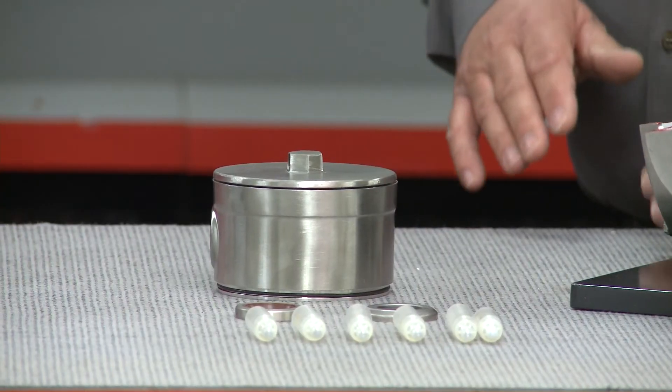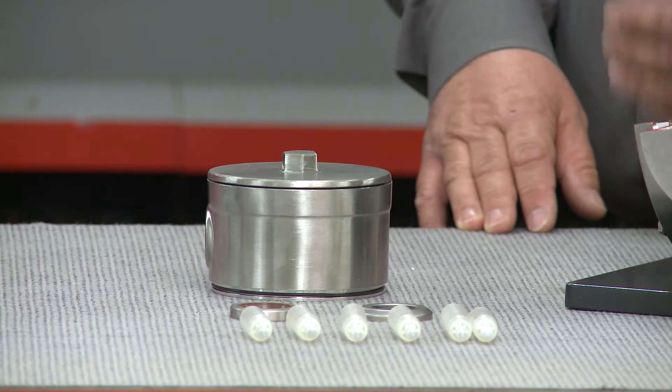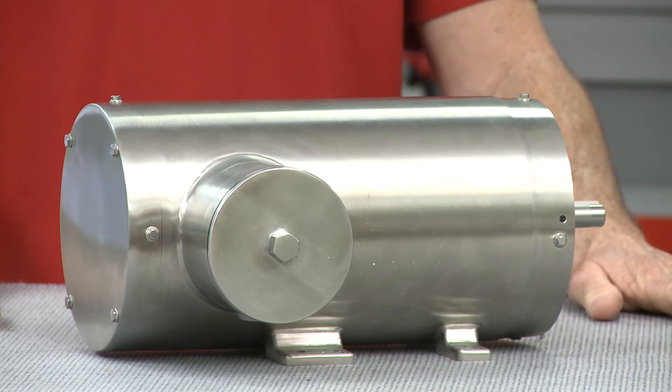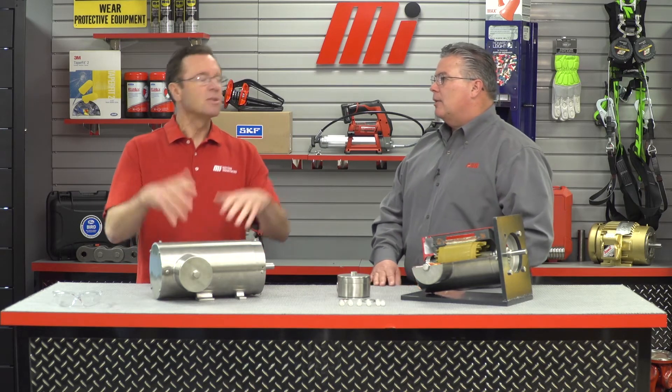The windings are fully encapsulated. The connections all have encapsulated connectors for sealing out water. Drains and hardware are smooth. Another feature is that the footed product has independent feet, which allow for easy cleaning under the motor and around the feet. So the features are there to prevent any kind of pooling and the growth of bacteria — because when stuff sits, stuff grows.